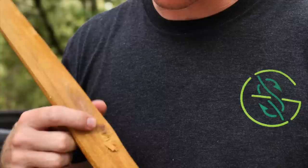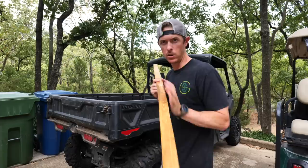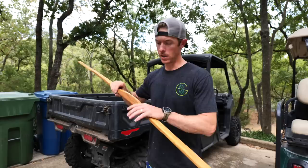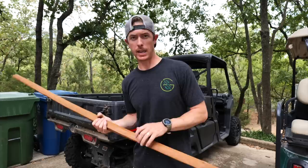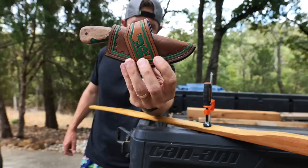I can already see a big problem area right here. I hit this knot with the draw knife - not meaning to, just got going kind of quick. There is also a slight propeller twist in this bow, meaning the limbs are turning opposite ways. That happens sometimes when the wood dries. What I'm going to have to do, once it's shaved down more, is heat this wood up, then bend it with pressure to get it straight, and then we'll finish the full tiller. Right now let's clean up this knot and get it to floor-tiller decently.